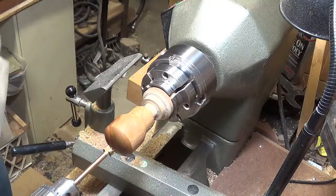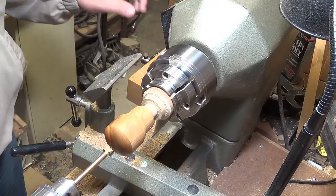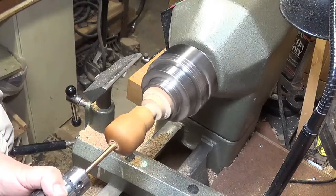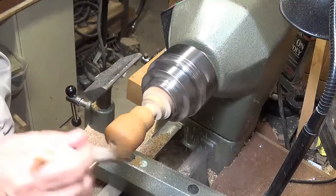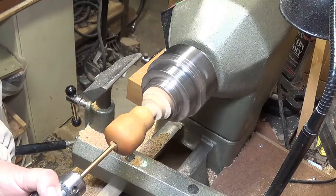I'm ready to drill the hole in the top of the knob. I'm going to drill a half inch hole, and that's large enough to put a quarter inch nut in the hole. I'm spinning at 500 RPMs. One of the other suggestions I got was to use a brush — a small bristle brush — to clean out the bit. Removing all of those shavings keeps the bit cool and keeps it cutting.